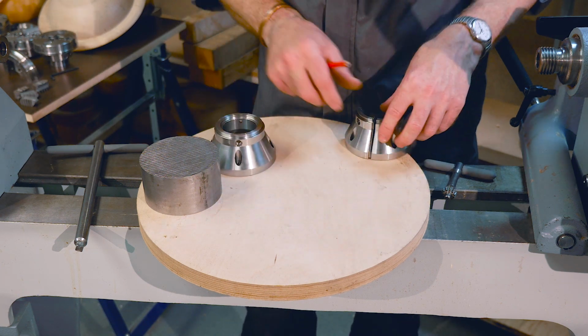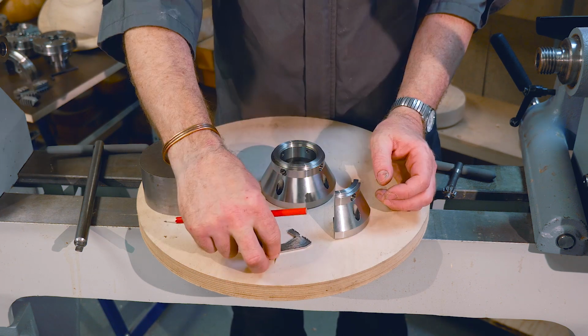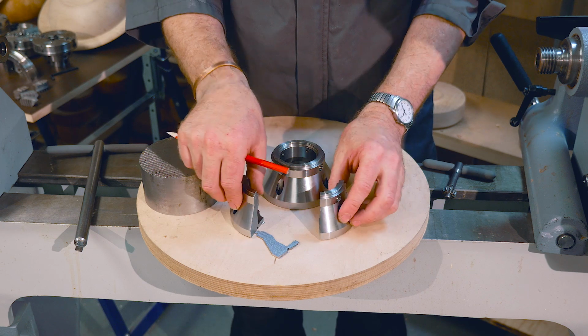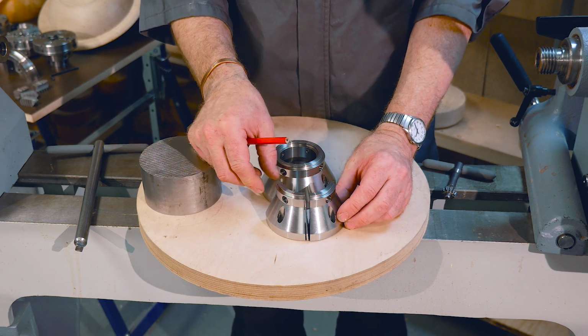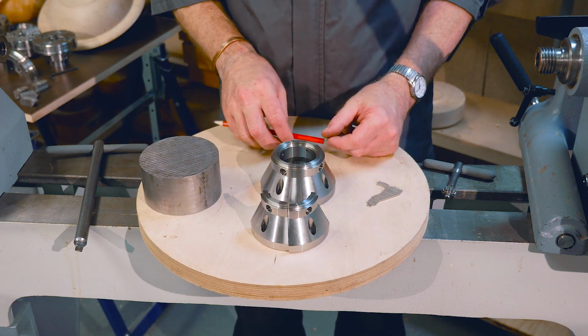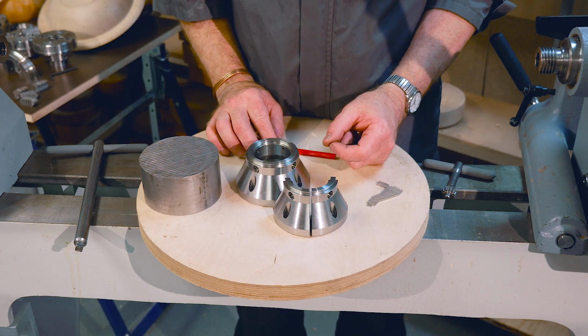From there, they're quartered. So this gets cut into 4. When they cut it, they also take out a section. So we're losing about 1/4 of an inch between where we have our true circle. So we're actually cutting that amount out. That gives us more movement on the chuck jaws, so allows us to grip a bit more. We've got more movement on the chucks than just what we would have with the true circle.